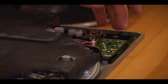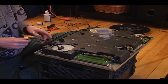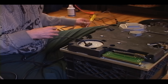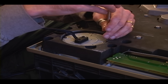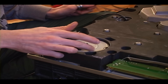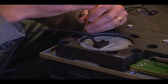The circuit board we're after is actually under here — we have to do a little more disassembly to get to it. We want to remove this cover and this little anchor which holds the wire. The tonearm is not electrically connected to anything else on the turntable other than the ground wire — there's no power running through it. If you turn your turntable off and unhook it from the wall, as long as you still have these leads hooked up to your mixer, you'll still hear sound.